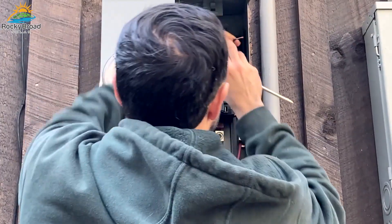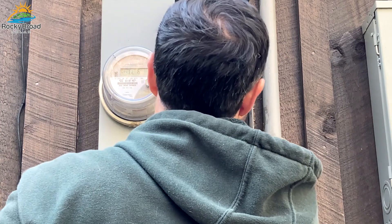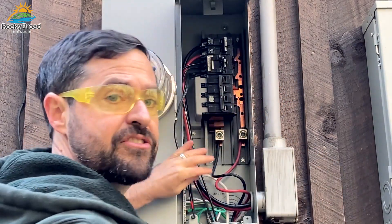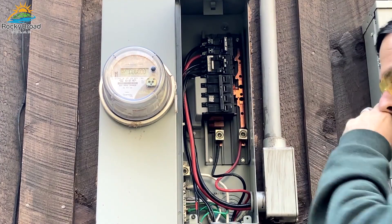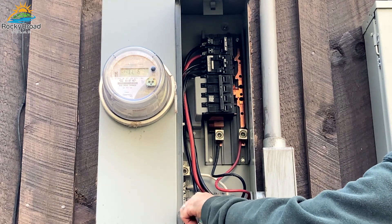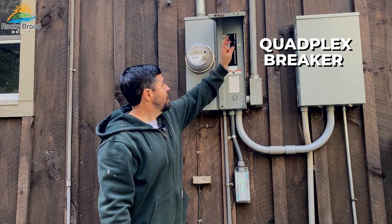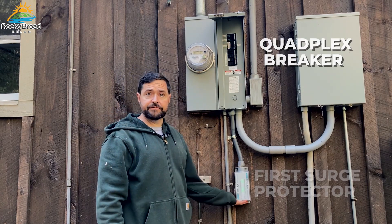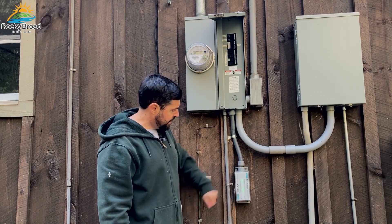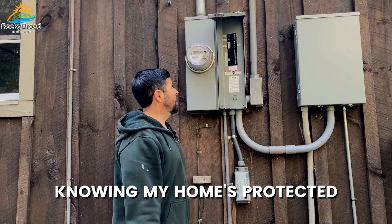I'm not going to make you guys watch this, but essentially I'm just going to get these wires in here and try to avoid the bends as much as possible. Tug test — we are good and secure. Now I'm just going to manage these wires down in here. We are good. I'm going to go ahead and close this dead front cover up and turn on the main breaker. Everything's back on. I hit my quadplex breaker to energize the surge protector. I got my green light showing everything's good to go — does that make me feel warm and cozy inside just knowing my home is protected.